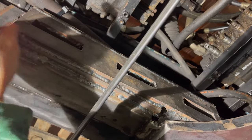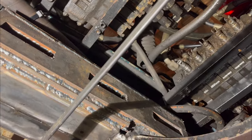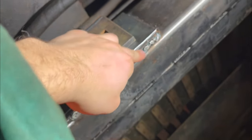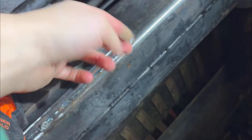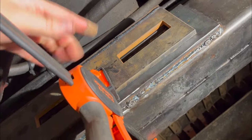We've got Austin grinding away. Back under here — we've got this side pretty much done. I put in the spacer and welded on this three-eighths piece. It has an angle on the top so it actually rides on the top of the frame rail, which'll keep it from flexing a lot. It sits way back in here, braced and welded. I'm about to do the same on this side. I just burned in this — there's oil all in the surface, which sucks when that happens. I just welded this guy in.